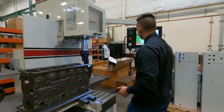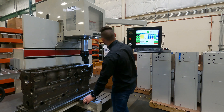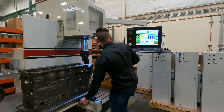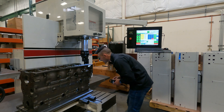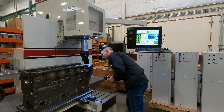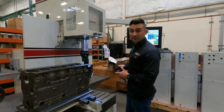Take the backlash out of these — I'll go past and come back. I'm watching my scale up here. Split the difference at two tenths and sweep. Zero and negative six tenths... zero. Just a hair. I got it within two tenths there.